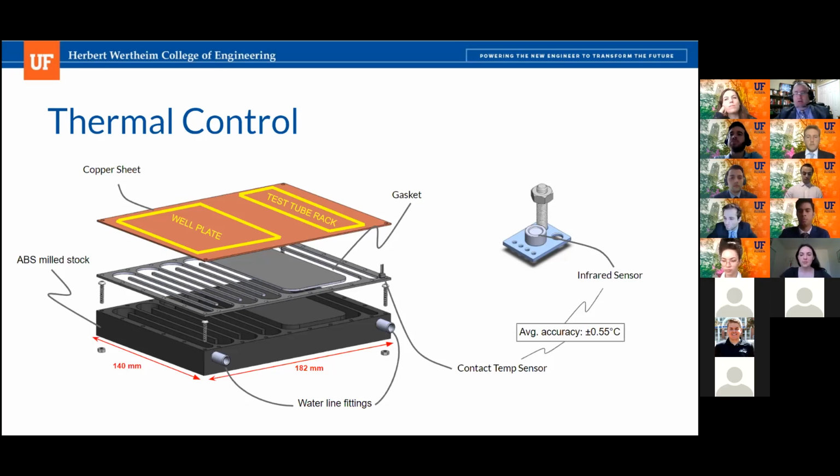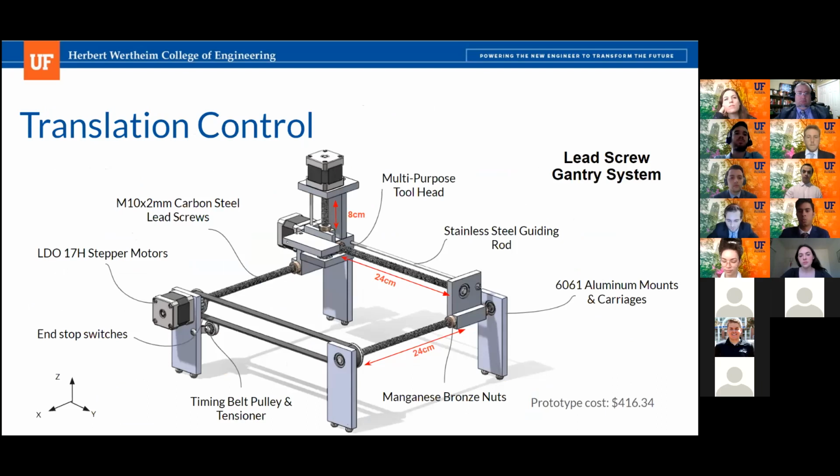Yeah, I have a couple concerns, or actually one concern. On that belt drive system, did you look at the initial force you'd have to apply to overcome the sponginess of that belt, and what loads you have to overcome on that remote lead screw?